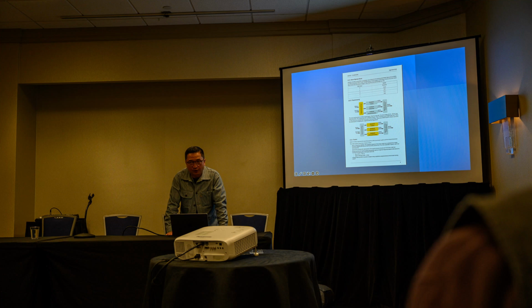But here's the thing. So Sean was here. This is one of the little points of debate we had. He says headphones are mostly minimum phase devices. So the time domain information, frequency domain information, it's in there. So when they asked him here, actually, I think maybe it was here, yeah. They said, what do we have to measure, Sean, when we measure headphones? He said, frequency response, frequency response, frequency response. So that would, I agree, be number one.